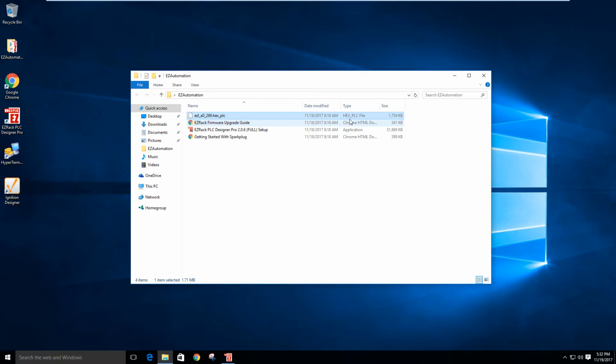Otherwise, you have to write a parser on the broker side where you're consuming the payloads. You've got to write a parser to understand how to create your tags, so you can then build your screens. So this is Sparkplug B compliant. There are a couple of things they're working on. They're working on store and forward. There is a tag limit right now, a topic limit, I think, of 96 topics, and I think they're going to expand that to about 250. It's a function of speed.